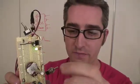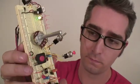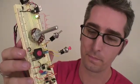Stage four: set up the delay. In this delay section of the circuit, I've added a push button switch to restart everything and a potentiometer. A potentiometer is a variable resistor so that it can vary the time you have to wait for the next person's turn. Okay, here we go — it's your turn. Now it's my turn.